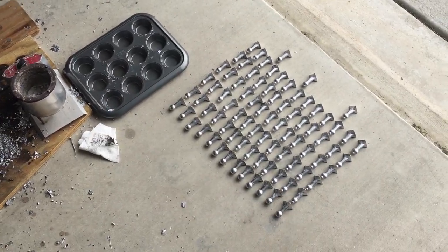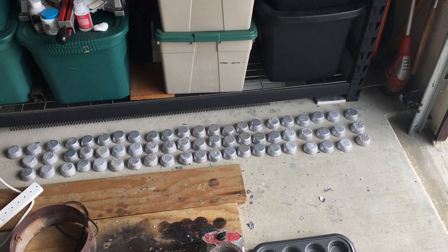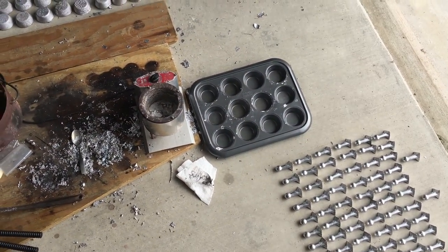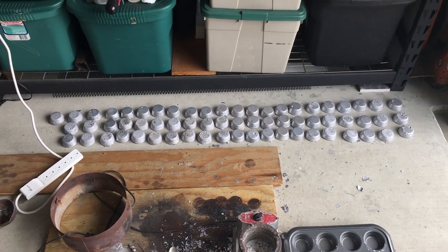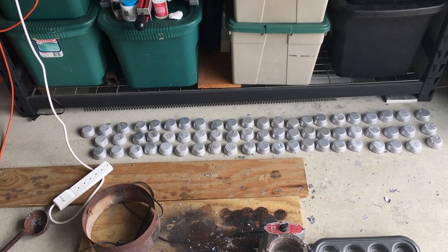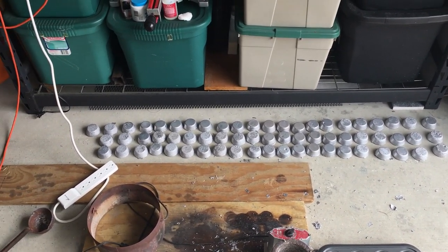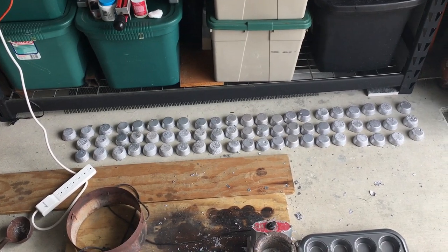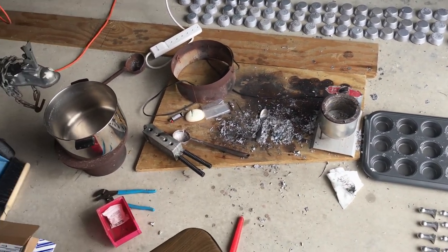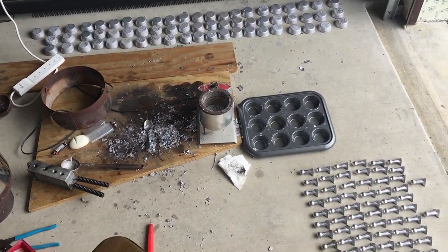When you're making your pours, don't fill your ladle to the top — all it's going to do is make it a lot harder to make the pour. Just get what you need; about a half a ladle full is going to make the pour a lot easier. And that's a wrap. We got 81 five-ounce sinkers made and 61 ingots made. Those ingots, from the top of your cupcake tin, are going to be about one pound ten ounces per cupcake — that's a little over five sinkers per ingot. So that's about 99 pounds of lead, but almost 500 sinkers. That ought to hold me for a couple of days! I hope you liked this video. If you did, subscribe to our Pompano Brownie channel, and that'll do it for this video.